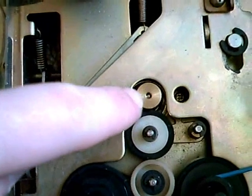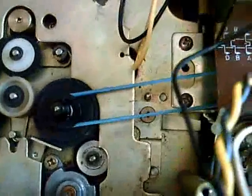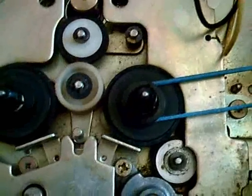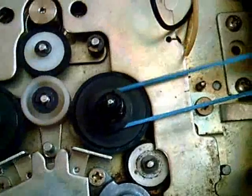I also lubricated the motor for rewind and fast forward — this motor was lubricated before. Finally, I'll try to replace these rubber bands with normal belts. I had to put in these rubber bands because back when I got the unit the original belts were bad. And down there is the sensor for the auto-stop, so if the counter doesn't turn, the whole machine stops. Back then I tried replacing the original belts with some other belts, but those belts were too tight and rewind and fast forward wouldn't work at all. So I'll try now to replace these bands with a normal belt.